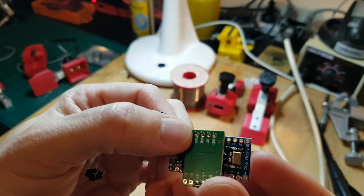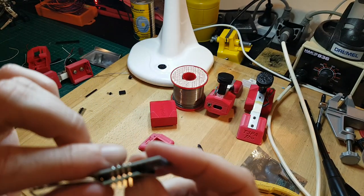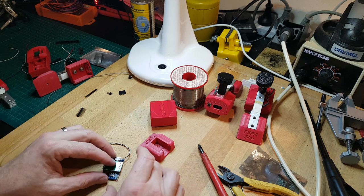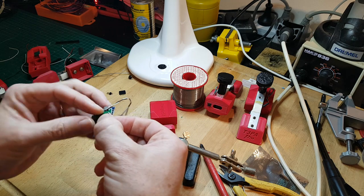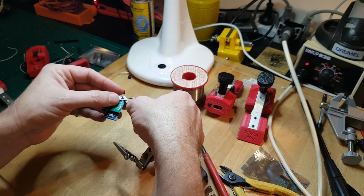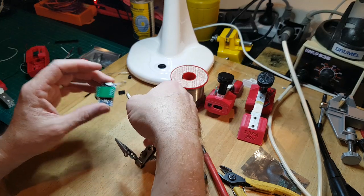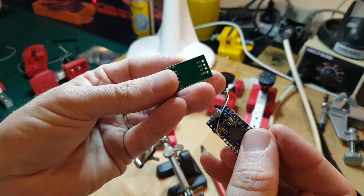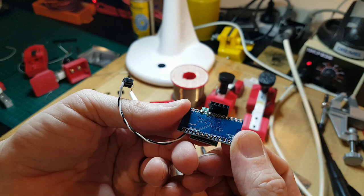And you're probably going to think, but Mr. Ramjet, that is a ground pin on the end, and you've got that going into an analog pin. Yeah. The HX711 board actually only draws about 1.2 milliamps. There's not a lot of current, in all fairness. And I have configured that A1 pin as an output, and I've configured that to be pulled low. So I've effectively turned it into a ground pin by pulling it low. Then the A3 and the A2 I use for the data and the clock signal. So convenient, it just sits over the top like that, and look at that, just super compact.